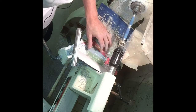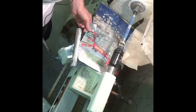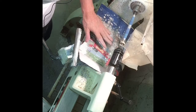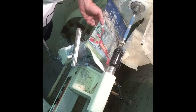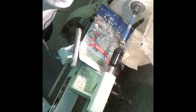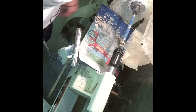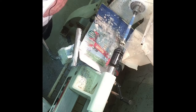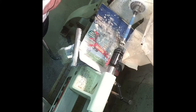Now the dust collector is off and I'm going to do wet sanding. I got a little plastic-coated piece of cardboard with a notch cut out that fits nicely around here — it protects the lathe. I use that when I do a super glue finish for wood. For acrylics you don't need super glue, but for wood I'll protect my lathe here. Now I'm going to use a 1000 grit and then I'll go to the micro mesh — I have a separate 1000 grit that's not part of the micro mesh.